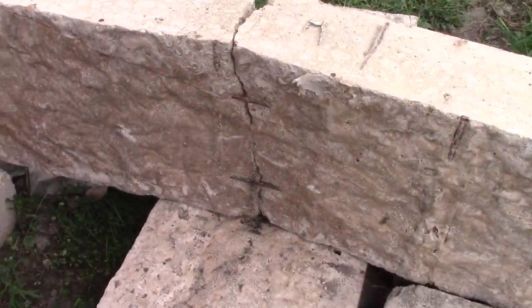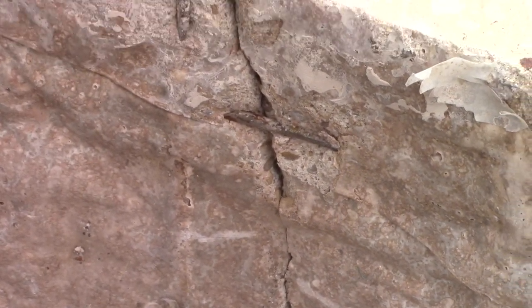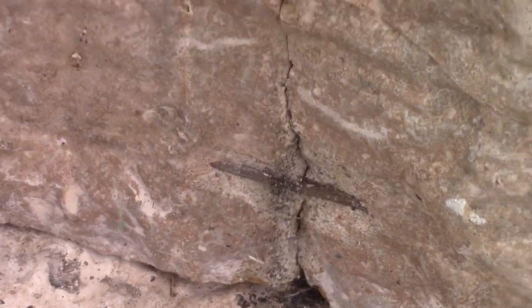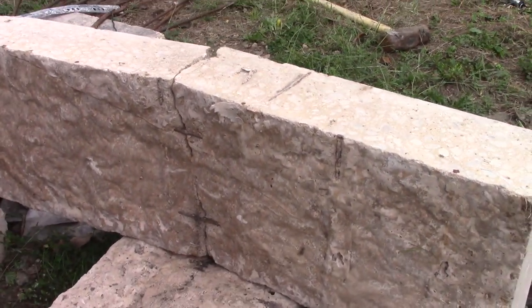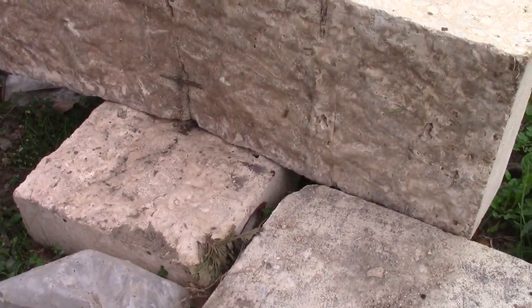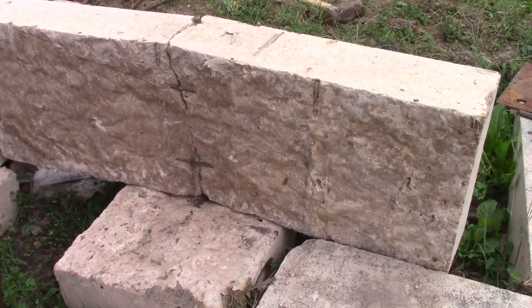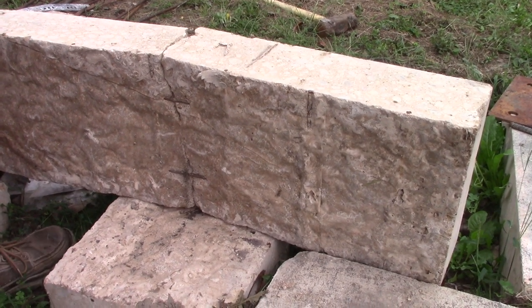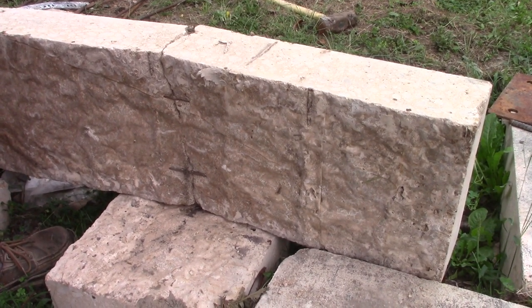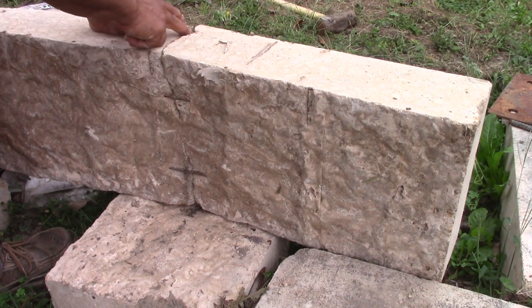The reinforcement is in the format of wire mesh, which you can see there, and the two pieces upon the full fracture. So if you were going to do a repair of a fully fractured deck like this, obviously, if it's loaded from this side, it will just open up.